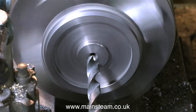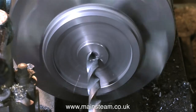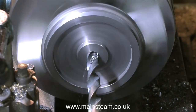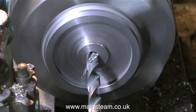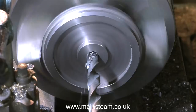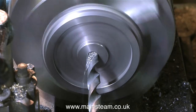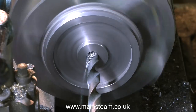You can see how the centre hole pulls the twist drill into line. In exactly the same way as I talked about speeds and feeds when using a cutting tool in the lathe, remember that a twist drill is also a cutting tool. In the lathe it's stationary — the work revolves — but it's still a cutting tool, so if you go too fast things are going to go wrong. And also, if it's a high-speed steel twist drill, it will get very blunt very quickly if you go too fast.